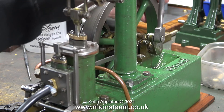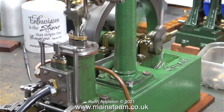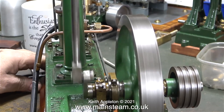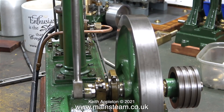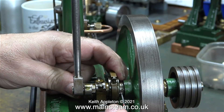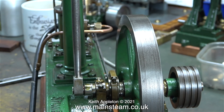What I'm doing at the moment is making a final tweak. Whenever you disturb an engine's settings it's always a good idea to double check the setting of the eccentric and of course the valve position. By now it must be obvious why I fitted an allen head grub screw onto the eccentric sheave — a slotted grub screw would have been broken by now.